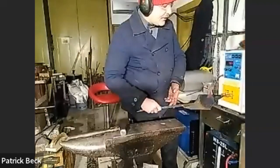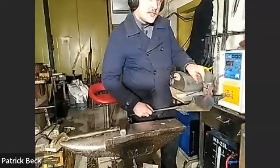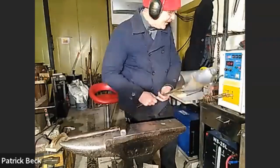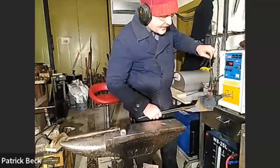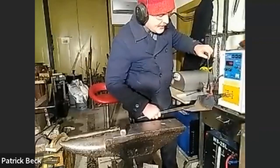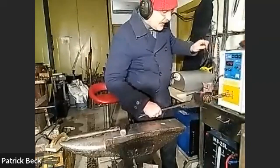We're already at 22 seconds and this is only two millimeter material, so this method is really inefficient. But it can sometimes be much better than nothing. You can notice that where the material is relatively close to the coil, it's heating more than in the other spots.